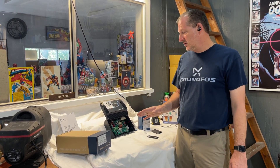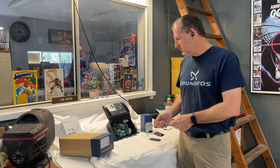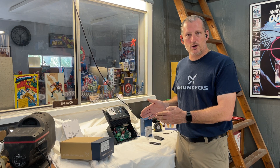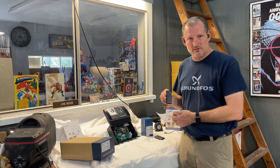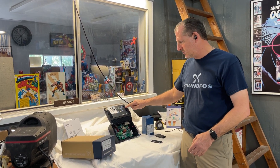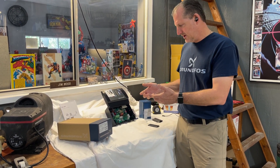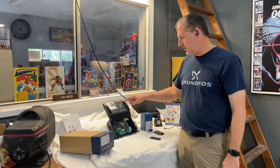This process probably takes 20 to 30 minutes, going in and out of the app and making setting corrections. Sometimes you'll think it's not working — if that happens, make sure your dongle is paired to the phone and that the infrared has connected. You'll know it's working because you'll see a flash happening on the controller itself. If it's not doing that, kill the power and try again.